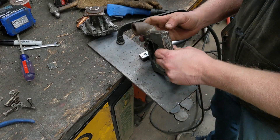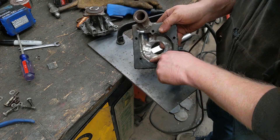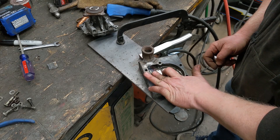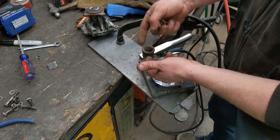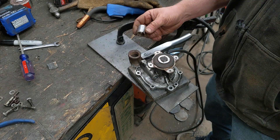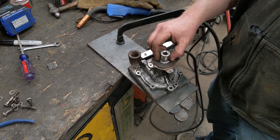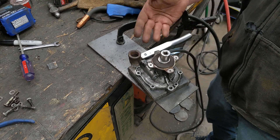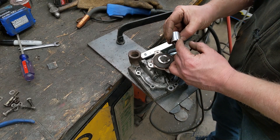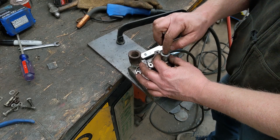That's all welded on and I welded around all the sides, tried a couple different techniques just to seal it all in, and put a weld bead riding around there. I took the carbide burr and ground that down a little bit so it flows in through there better. Now you're asking how do we turn this into a drill-powered pump - we just take a socket and weld it to the top. Then we can use a myriad of different attachments at any length to make it drill-powered - we could make it five feet if we really wanted to. I drilled a couple little notches on the side so if any fluid fills in there it also drains out and doesn't just pack full of fluid.